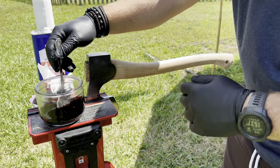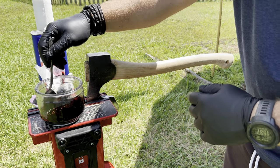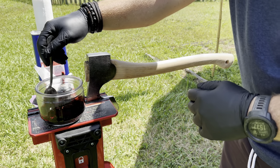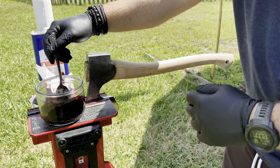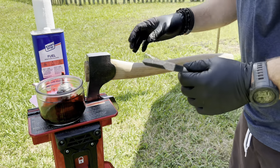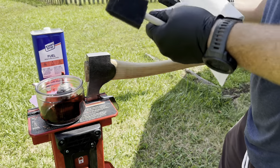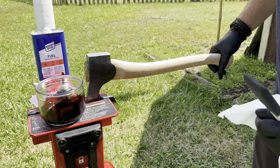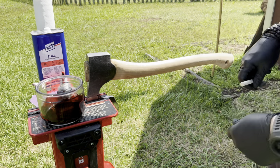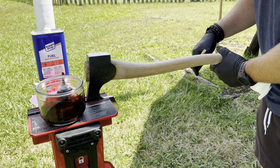Which is really cool — if you don't like it, you can always sand it off. Also, if you think it's too dark, you can wipe it down with a paper towel soaked in denatured alcohol and it'll lighten the color. So I like to go darker because I can always wipe off the excess and make it lighter. When I go to apply it, I use one of these foam brushes. When you apply this TransTint dye to wood, you've got to go fast — if you do it really slowly, you'll get streaks where the dye has sat for too long. If you just want to put a single coat on, you've got to move quick.